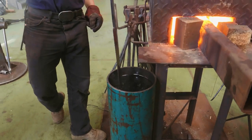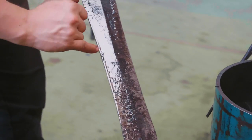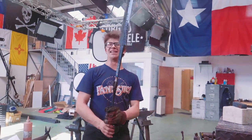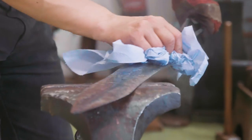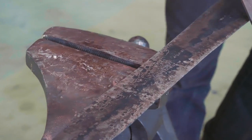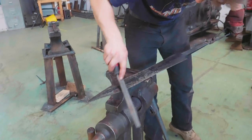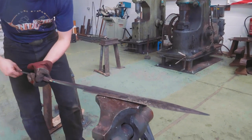From what I can tell, this is going to be just fantastic. It's almost all the way cool. You see this grey - on carbon steels like this, that grey, I believe it's martensite. It's always wonderfully indicative of a correct hardening. This should be just fantastic. This is now a hard blade, which means it is very, very brittle. We'll check the hardness - not a single bit of bite. That is just perfect, that's exactly what you want. No matter how hard I push, it's just skating right off. That's a hard blade.